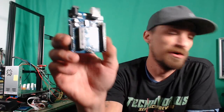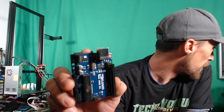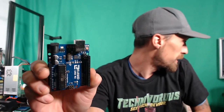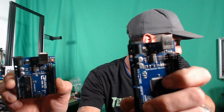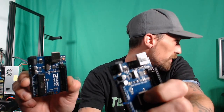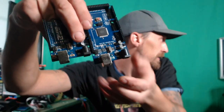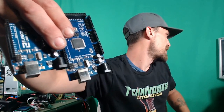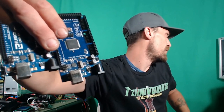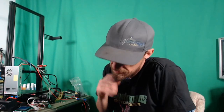I have an Uno. Now, this one isn't going to work because it doesn't have all the pin outs that I need, but if you take a look at that piece up there in the corner, that is what it should look like. Just kind of a quick comparison of those two and what they look like — this one is most obviously fried. You see the difference in those two components? The one on your left is completely smooth. The one on your right has a weird blobbing artifact and looks like it melted a little bit. Well, that's because it did.